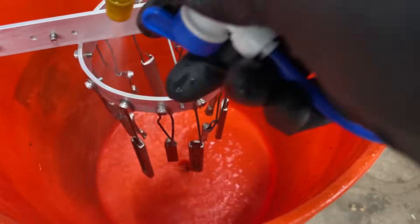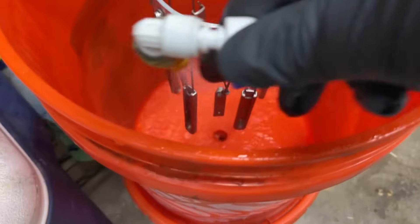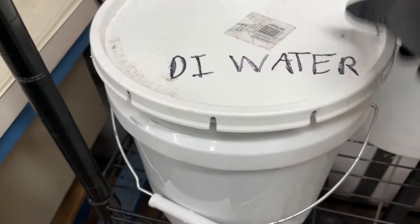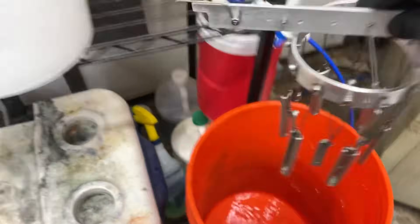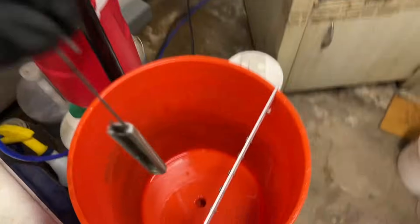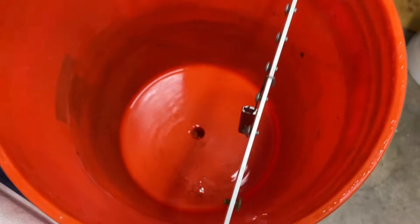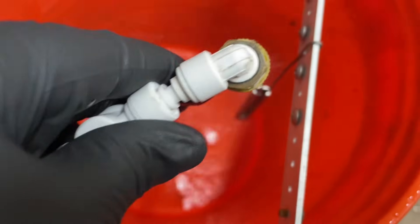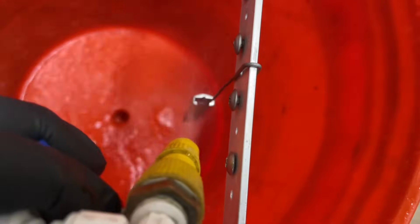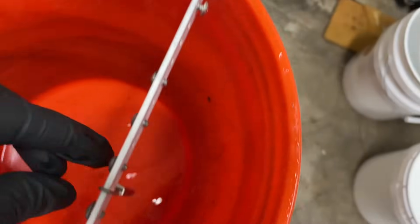I do a high mix of colors — I offer a hundred different color combinations, which is essentially ten colors on two parts, all colored individually. This is the waiting tank where I loosen all the fasteners. It allows me to pull all the parts separately and dye them by themselves, so I can do a bunch of parts in a bunch of different colors without having to run separate anodizing cycles.